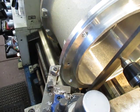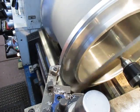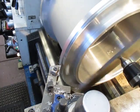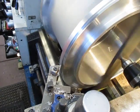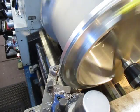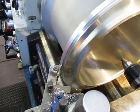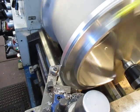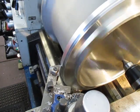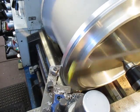We're in the lower gear and running at 270 RPM, using the cross slide to go into where we need it to be. We'll just run that last cut — we've already done one cut. We indicated it in to make sure it was running 100%, and now we're doing the final cut. This is the third of the bunch and I'm quite pleased I didn't have to put the four-jaw on — I prefer not to if I don't need to.